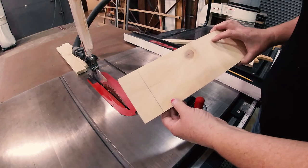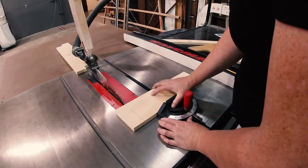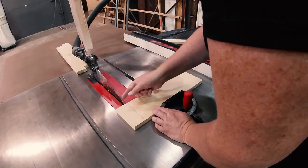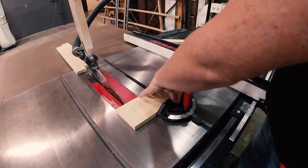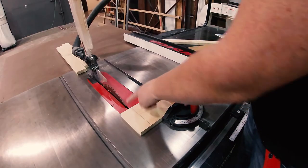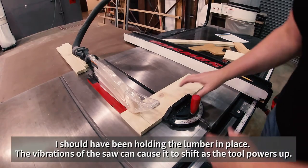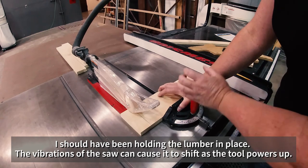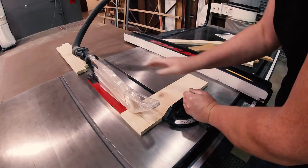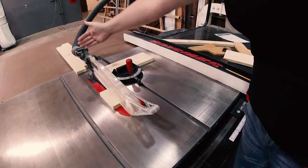On this piece I've marked the wood with a pencil line, so I want to line that up to the blade. I adjust the wood, come right up to the blade, and shift it left or right until the pencil mark is lined up with the side of the teeth. Then I back it up — holding it firmly in place so it doesn't shift — so it's no longer touching the blade. Bring the guard down, grip it tight so it can't wander, and cut past the blade.